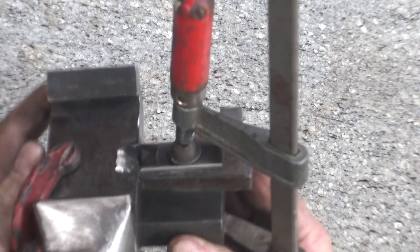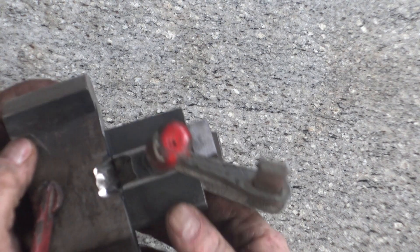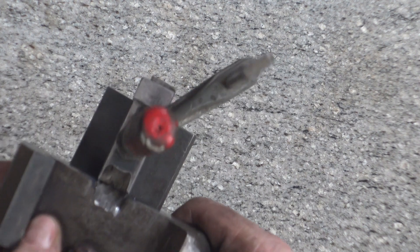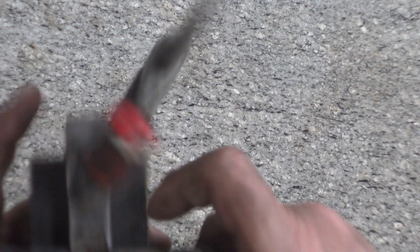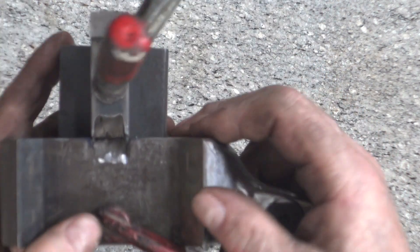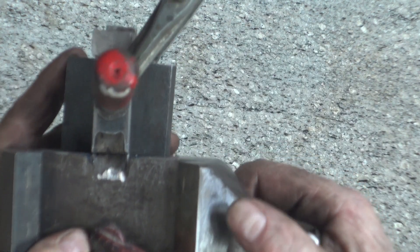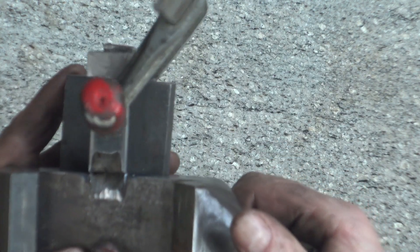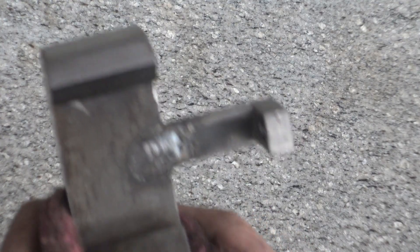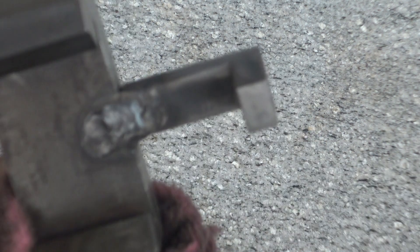This is the welding setup. There's a block on the back to space it out so it'll be in alignment with this face. Both sides are ground out at about 45 degrees to give me somewhere to put the weld. And I'll just build it up on the inside using a 3.2mm rod. There it is welded up from the inside only, with a little tiny bit on the outside to clean up with a file — but the principal work is going to be here with an angle grinder.